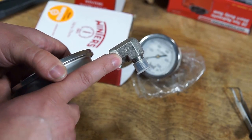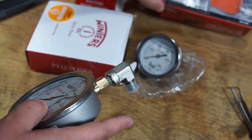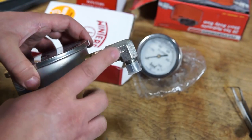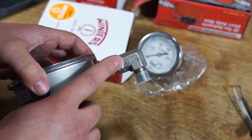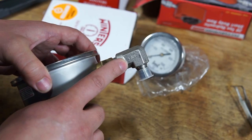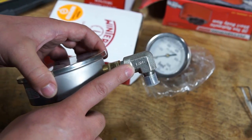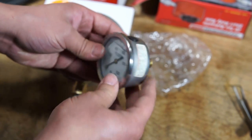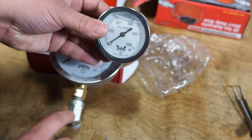going to need if you want to take advantage of the full capacity of this hydraulic ram. I suggest buying a gauge where you don't need a fitting. Getting an appropriate fitting can cost more than the gauge itself, so keep that in mind. You can buy these gauges, they go up to a variety of pressures. I bought my 10,000 PSI gauge with the fitting going out the back, so I don't have to mess with